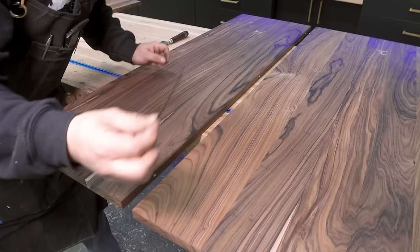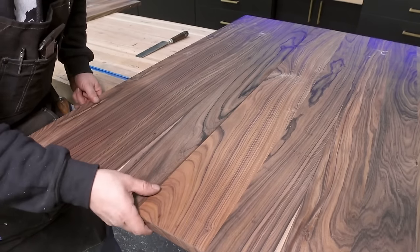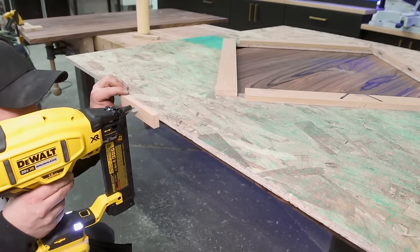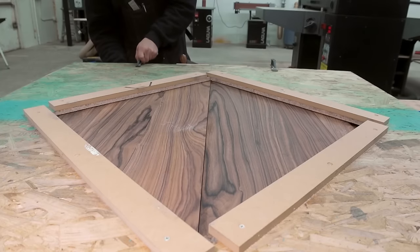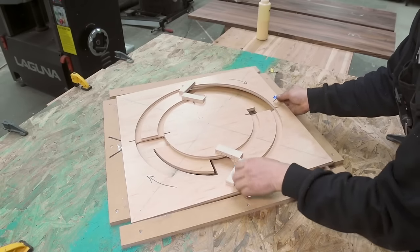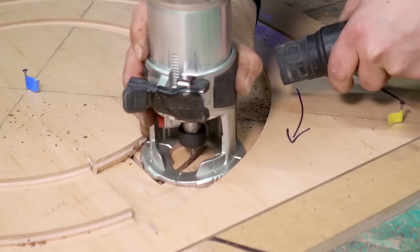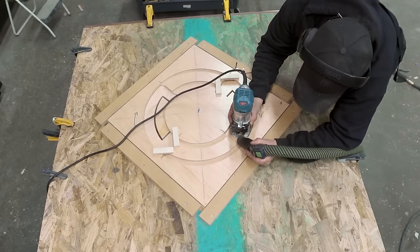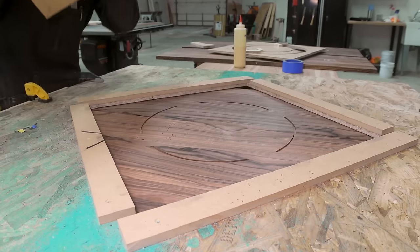It's time to take a big breath because we're about to cut into very expensive Bolivian rosewood, and I started with a mistake — you'll see why and how to correct it. I somehow thought I was being clever by leaving a tiny gap between the two panels so I can fit a saw in to cut the inlay apart later. With a stop connected to the end of the barrier panel, the diamond is positioned dead center with the joint of the two tabletop panels. Then with clamps holding both panels to the barrier, I can begin the process we've already discussed.